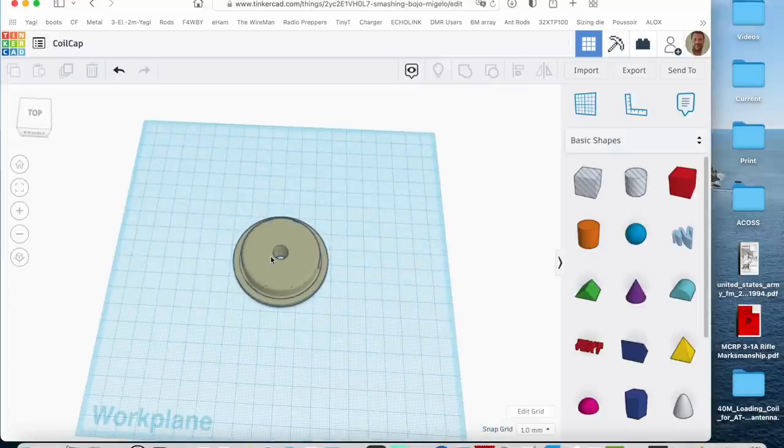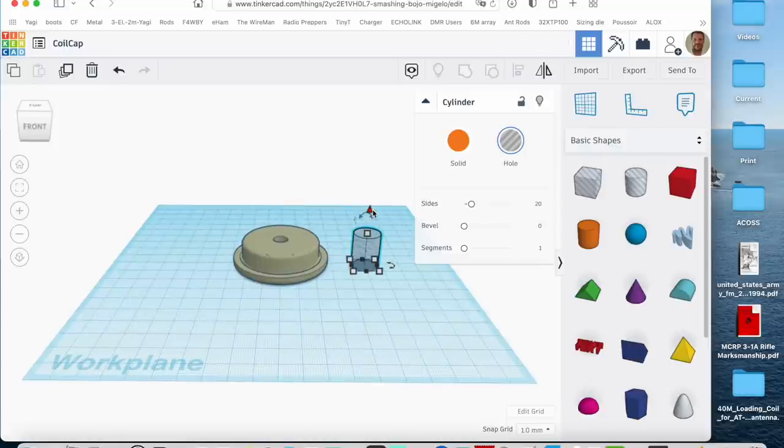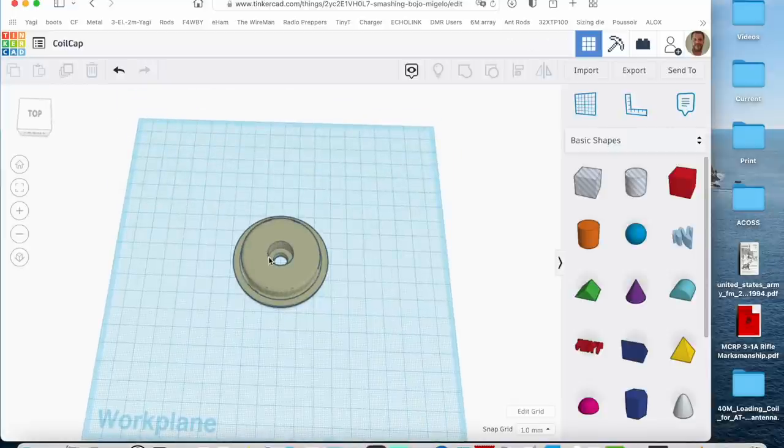I want some space here around to fill in epoxy, so I'm thinking like a 3-millimeter rim around the hole. That would be 9 plus 6 — that's 15 millimeters. I'm going to make another hole here at 15 millimeters and put it a little bit higher, about 5 millimeters from the bottom. It's going to make a rebatement, basically, so there's space to fill in epoxy around the threads. Hopefully it's not going to move.